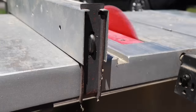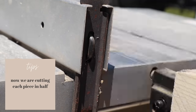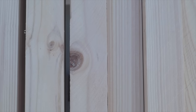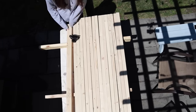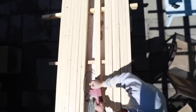Since this is just for our camper and we're not going to be using the kitchen a ton, we went the cheaper route. We cut a quarter inch off of each side of the pieces just to make sure everything was even, then cut the wood in half, leaving us with 16 pieces. Next we lined up each piece exactly how we wanted it, checking each side to see which grain looked prettier, and we sanded each side to ensure everything was flat and even.